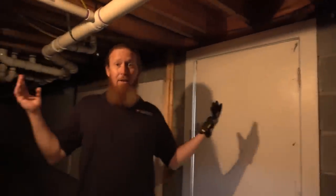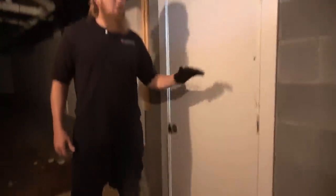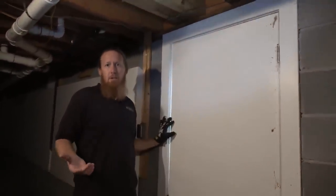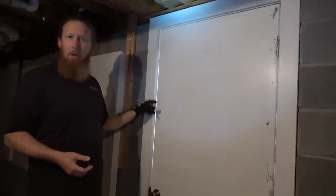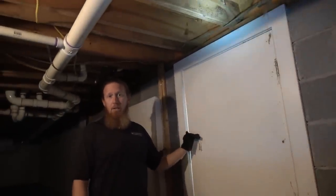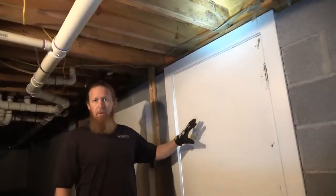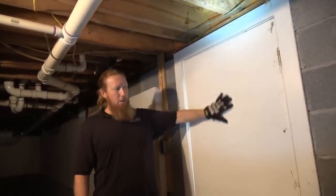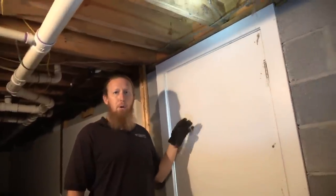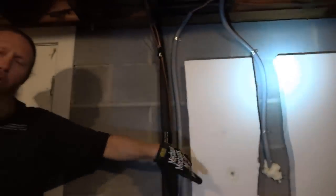Now I'm going to show you the door. Not all crawlspaces we do are this tall, but whether they're a full-size door or a small crawlspace door, you want to make sure you've got good weather stripping around it. If we install our platinum crawlspace encapsulation system and there's air moving right through here, it's going to make the dehumidifier work harder. You also want to insulate the door — we could put a piece of R10 foam board here, since most small crawlspace doors are not insulated.